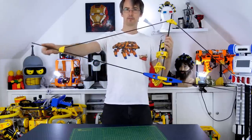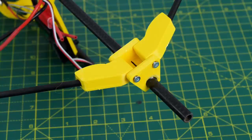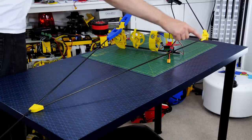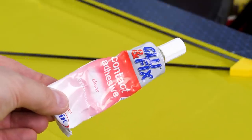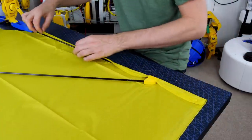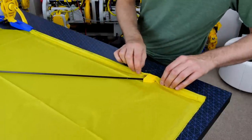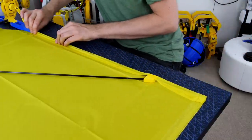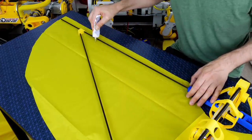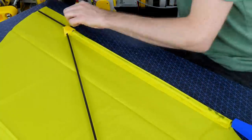The carbon fibre rod wing structure is very interesting and I'm going to copy it entirely. I haven't saved that much mass with this new structure so I've decided to make the wings slightly bigger, copying the triangle structure I've seen on other ornithopters. That's a hinge point at the back where the extra braces come back, and also brackets on the end, so we get this big triangle on each side to stretch the fabric over. I'm using contact adhesive and the fabric is ripstop fabric from Amazon - it's quite light, tough, and airtight, used for making kites. Instead of using packing tape, I'm gluing the carbon fibre rods in by overlapping the fabric and wrapping it round with lots of glue.